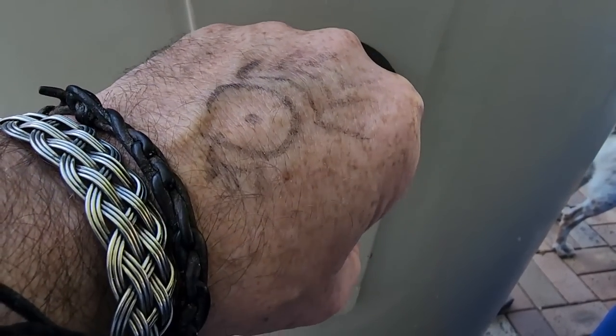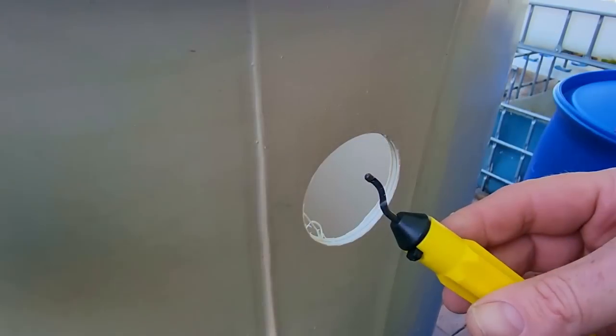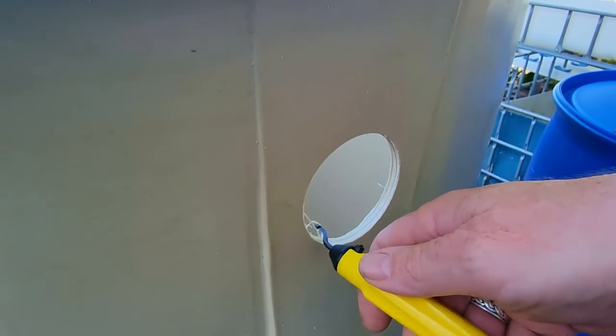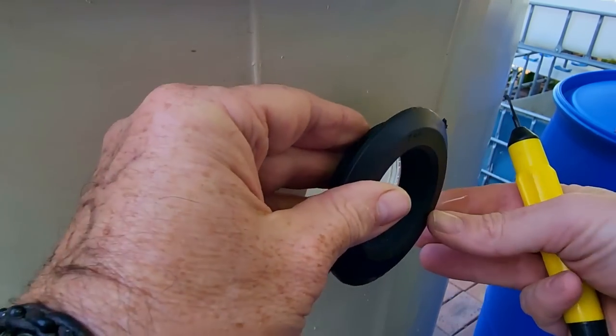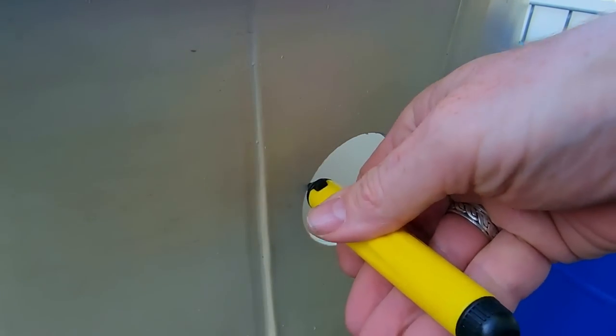By the way, Kira was practicing with her textas, so that's what that is on my hand - I don't have a tattoo. I've just got this little deburring tool - you can use the edge of a craft knife if you want. It just goes around like that and chops off any bits of swarf that may compromise the seal of the uniseal in the hole itself. The holes normally have a two millimeter tolerance either way.